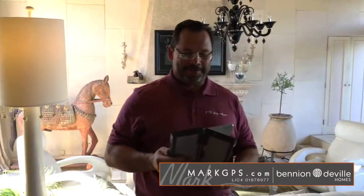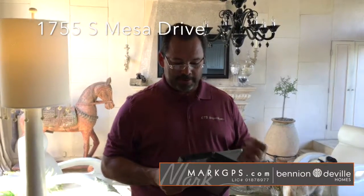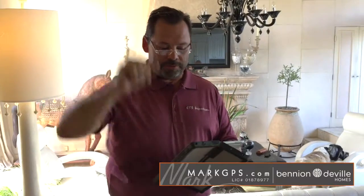Okay, go ahead. All right, first thing on the roof, you have a foam roof, and the characteristic of foam roofs is that they'll blister every now and then. You have a couple blisters up there adjacent to the south evaporative cooler. You have two evaporative coolers up there. And so you have some split blisters that I'd recommend having sliced, removed, and repatched.